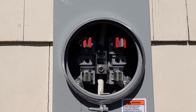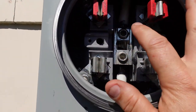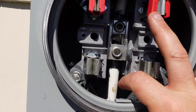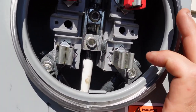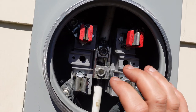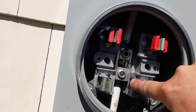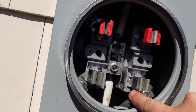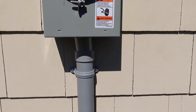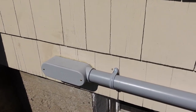Inside our 200 amp meter base, you can see our lines come down from the top — one hot on one side, one hot on the other side, and our neutral in the middle. The neutral connection goes at the bottom and into the pipe and into the house, and our hot out on the bottom on each side. This is what we call a single phase 120/240 volt split connection from the utility. The compound you see here is called anti-ox, and that has to be used when we use aluminum conductors to keep them from oxidizing.